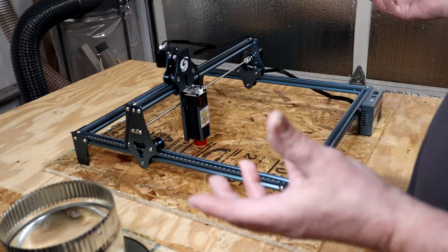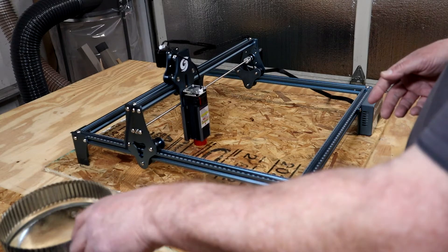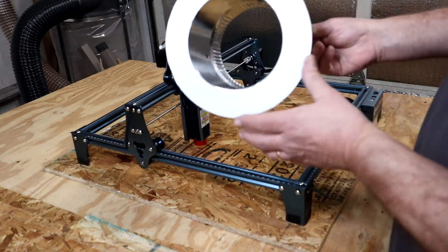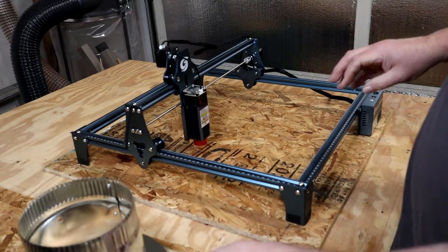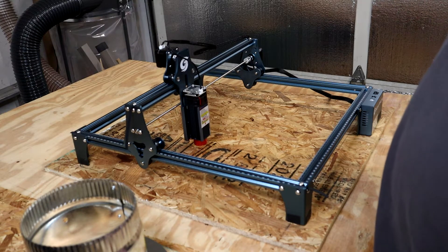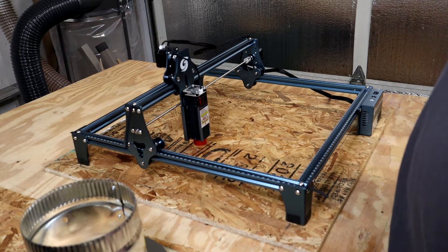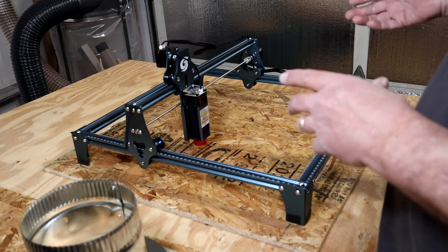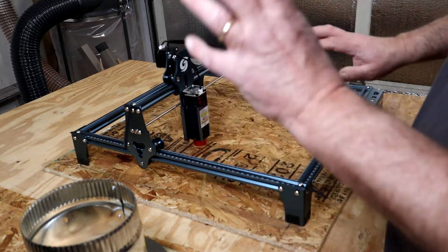On the back of it I'm going to be adding this collar — it's got a little sticky foam on it. I'll anchor it to the back, and then I have an inline six-inch fan mounted to the wall. I have a louver that's going to go on the outside of the wall, then connect it with flex duct. It should be pretty portable where I could remove it off my workbench when I need to lay out and glue boards up.